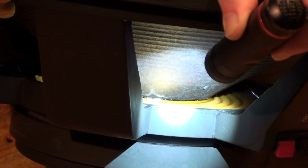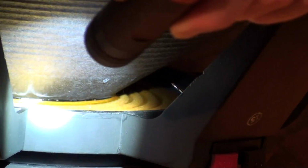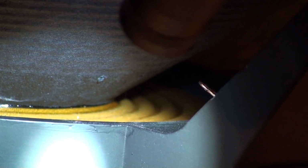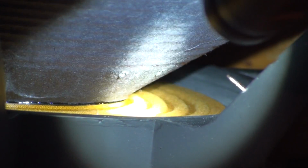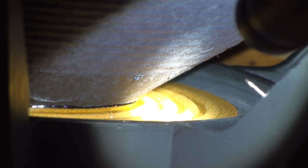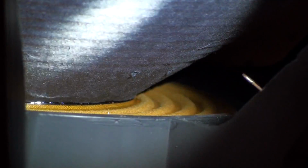You can catch it over in the light over there. You can maybe get a little closer, and I'll try. This is really important. I want to make sure everybody can see this. If you look inside there, there we go. Right in that area, you can see how it's a nice even bead, and that's how it's got to look. It can't be sticking out much further than where the cone meets the coil, otherwise it'll damage the spider. So that's pretty much how you want it to look when you're done.